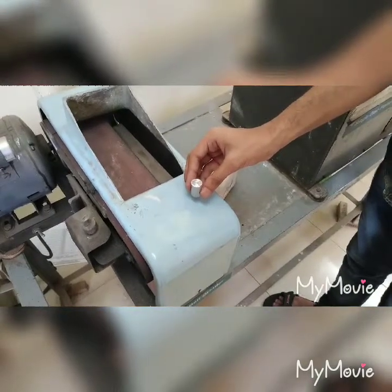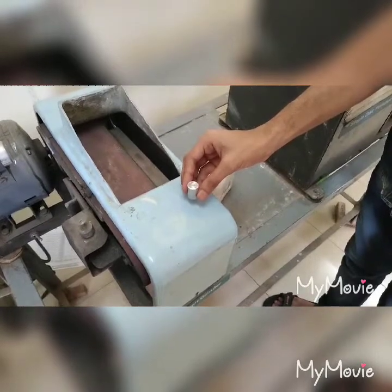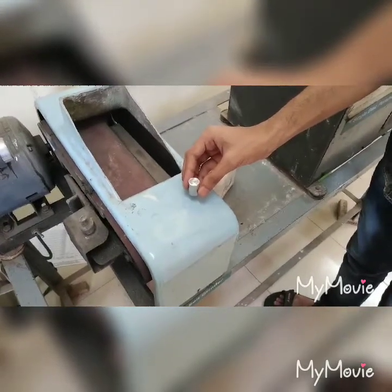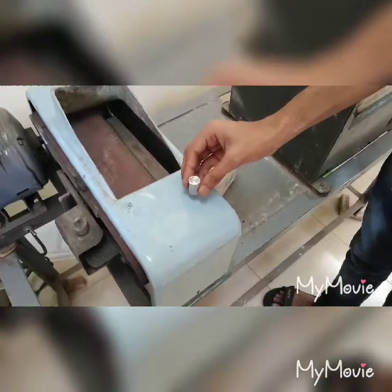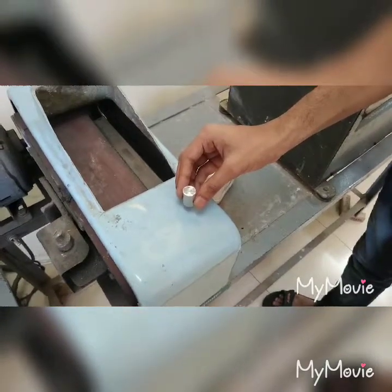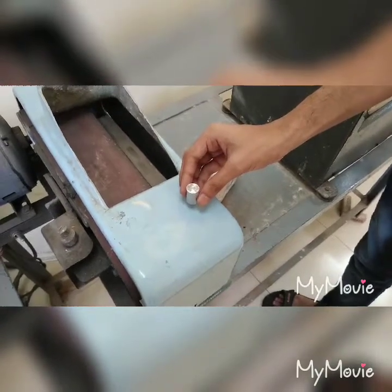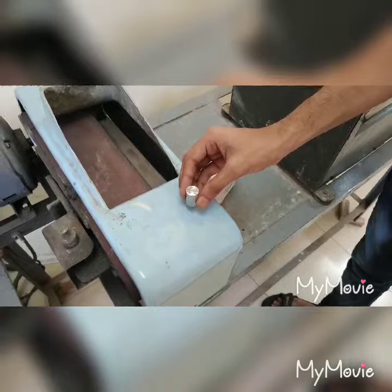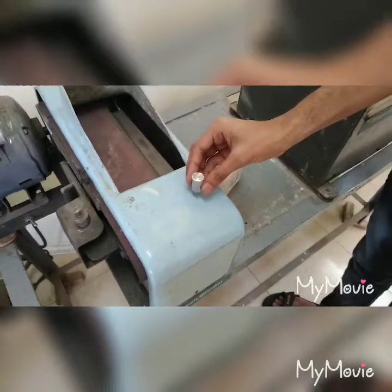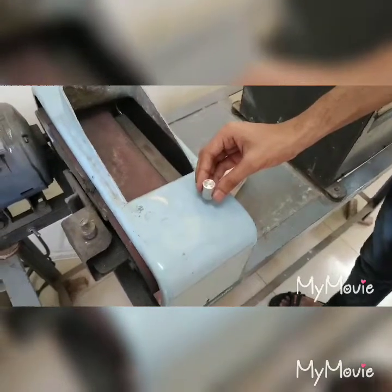During this process, the specimen may become heated and should therefore be frequently dipped into cold water. Excessive pressure should not be applied on the grinder or during hand grinding operations, because it leads to the formation of deep scratches which are difficult to remove. If the specimen is heated, it leads to microstructure changes due to temperature involvement, especially for metals having a low melting point.